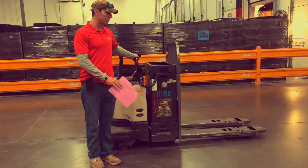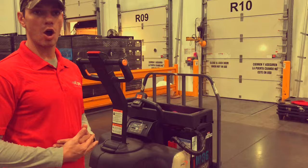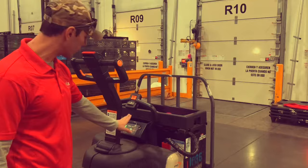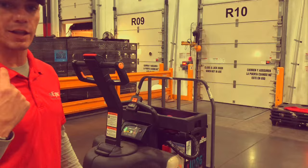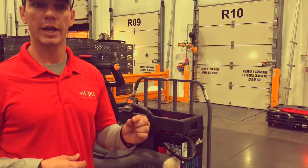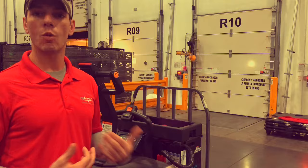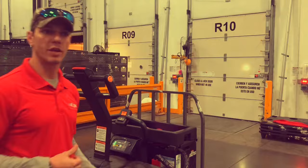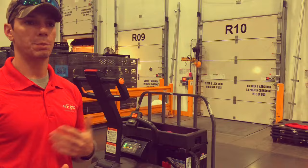When you go up to your equipment and turn it on for the first time, there's only one switch with a green and a red dot. You switch it to up and you're going to see everything light up. Give it a second for the lights to turn off and back on. If it's quiet enough, you'll hear a metallic click — when you hear that, you know everything's okay. Just like a dashboard on a car, you have check engine lights. Whether it looks like a little wrench or a battery symbol, if you see any of those illuminated, do not check out that piece of equipment. Bring it to the cage attendant. You also have an up, down, left, and right crosshair with orange buttons — we are never to touch those. Those adjust speed and other settings on the vehicle that we are not authorized to mess with.